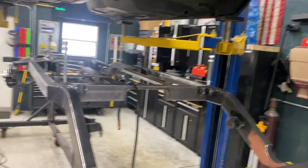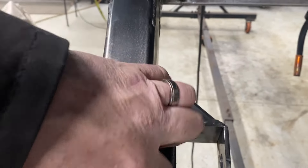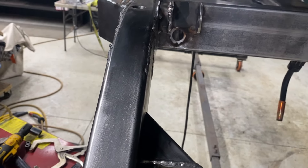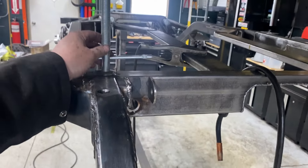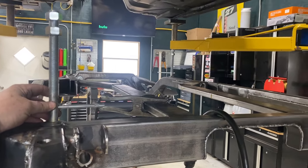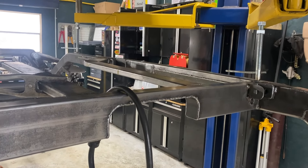Sunny side down. Now I'm going to go through and hit all these brackets that aren't welded yet from this side so I can get some good quality welds. Then I'll flip it back over to do the top side. This makes it super convenient to get all these faces welded up cleanly. I'll also cut off the jack stands so that when I flip it back over, I can put it together and eventually set it on the ground — that'll be a milestone.